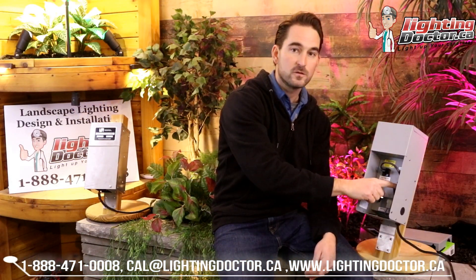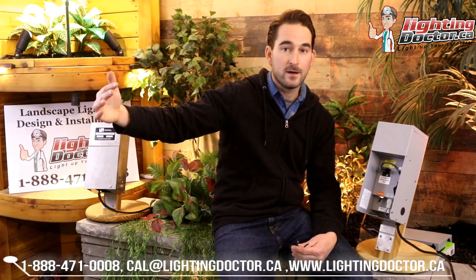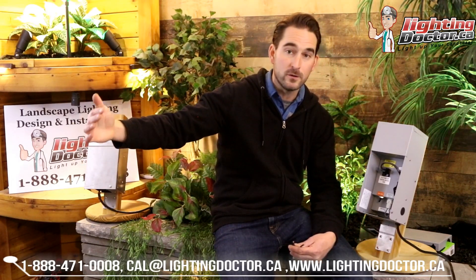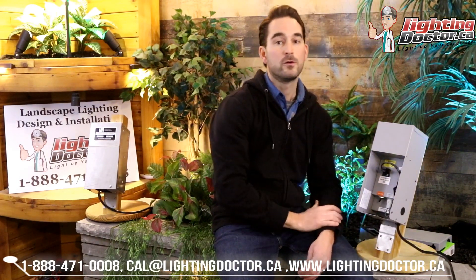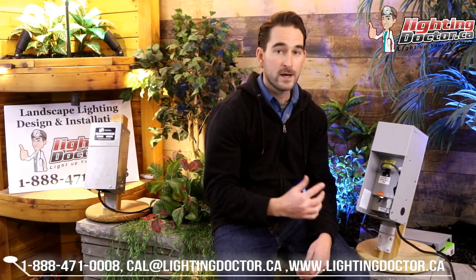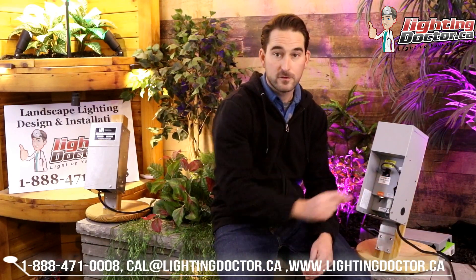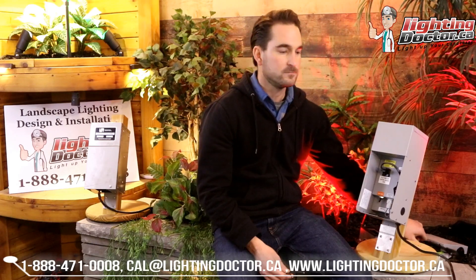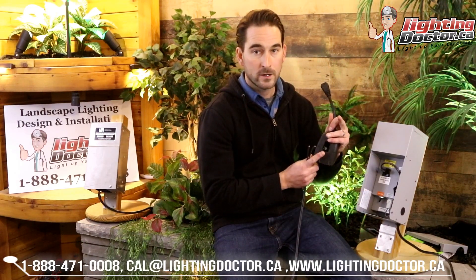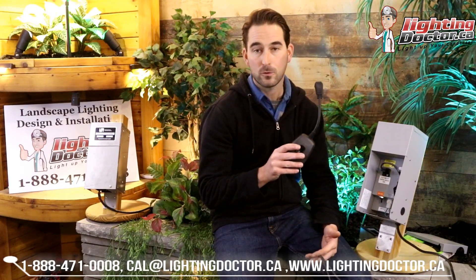You're still starting at 15 volts at the tap, which means you're not losing all the voltage drop as if you had 40 lights on one run — you're really only losing voltage as if you had 20, because you've got 15 volts starting from the transformer down both runs. That's an easy way to avoid adding multiple transformers and save money. You can run two or even three separate lines and easily fit those wires into this terminal. And to make this Wi-Fi enabled, you can easily do that with the YON timer — just plug this into your receptacle, plug it into your YON timer, flick the on switch, leave it on, and control everything via your app or Amazon.